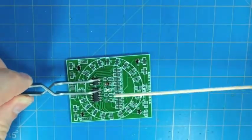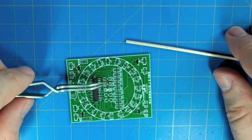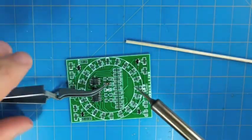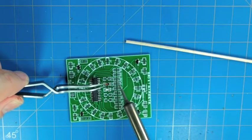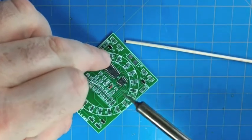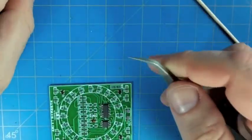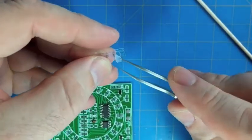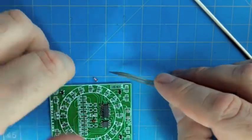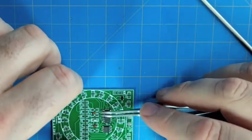So we're going to orient these 4 signal diodes, and these are the D12 through D15. We're going to orient them with that black line facing away from the integrated circuits. And if you look really closely at the silk screen, these 4 diodes in particular have a little diode symbol that shows you there's a triangle and then a straight line, and the straight line is the cathode, which is also the side that has the black marking on the device itself. So it's oriented in that direction. If you were to face the circuit board so that most of the silk screens, the ones that aren't in the circle, are oriented right side up, then the black line, or the cathode of these signal diodes, goes upwards towards the top of the board.